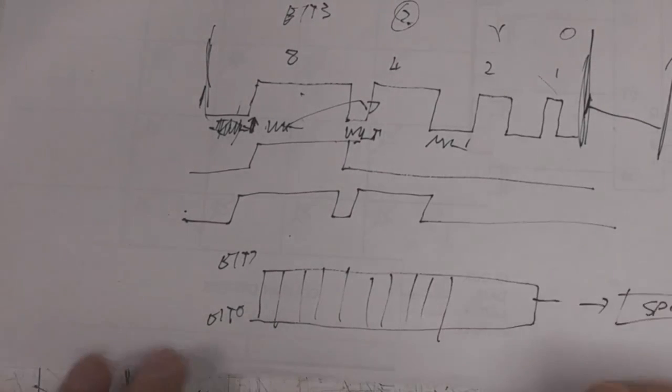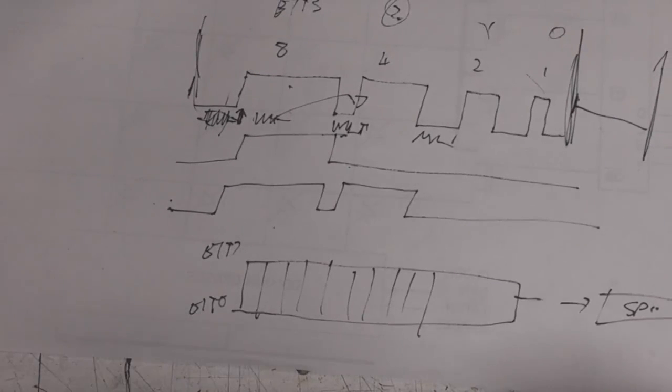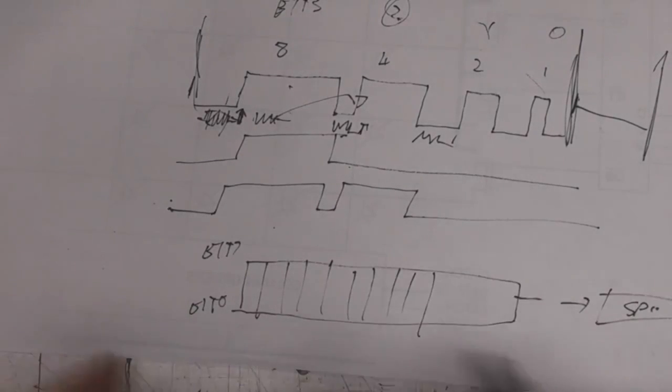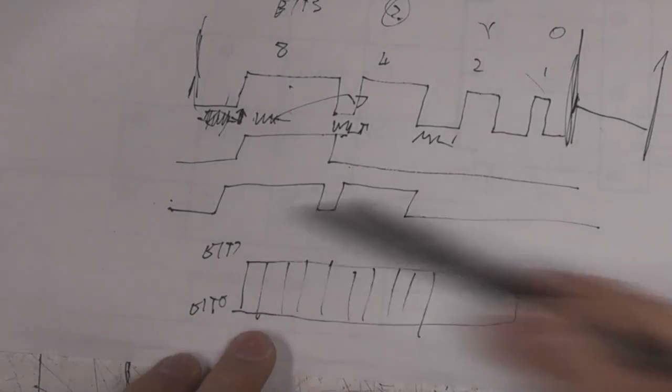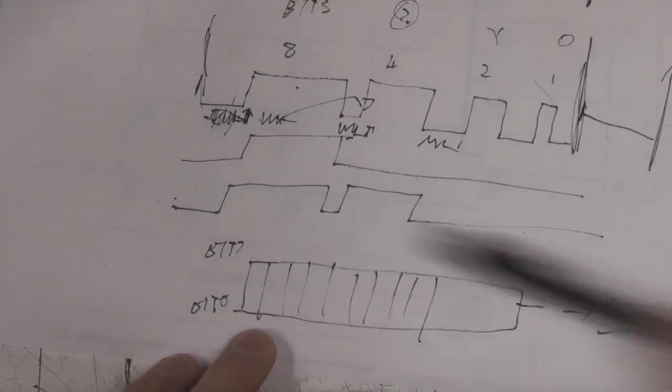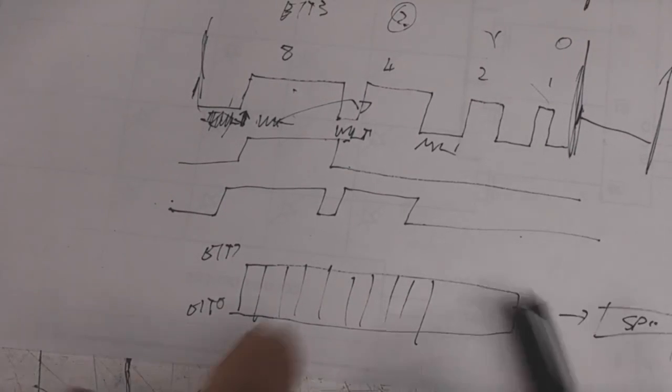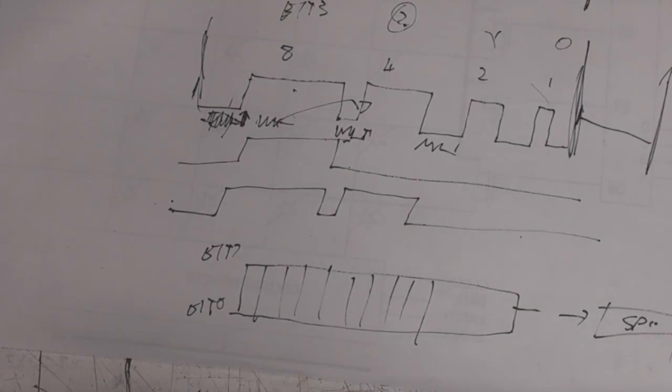Yes, you can do it, but it's the sort of thing that FPGAs are a lot more suited to, because you can just structure the data and route the data however you like. For example, if you wanted 9-bit intensity data, you could have 9-bit memory to do that, whereas that starts getting really messy on a microcontroller that has very fixed data widths.